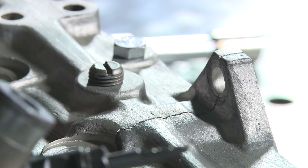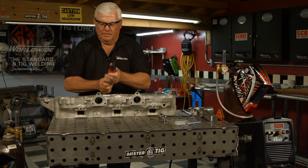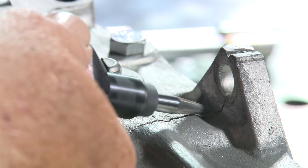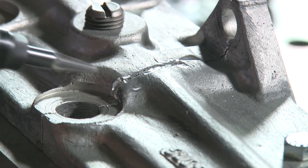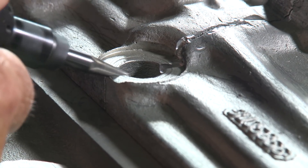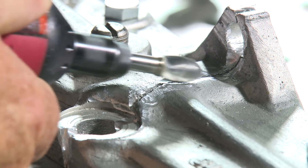I'm going to grind down this tab so I can get full penetration, focus in on this area and the back area so I've got it all lined up. Then I'm going to grind a little channel in there, and once I get the channels where I want, I'll go ahead and make a couple of spot welds. In my grinding, you probably noticed I was grinding away from where I'd normally weld — the reason is there's an oxide layer on here. This oxide layer is pretty tenacious; it melts at anywhere from 3,400 to 3,600 degrees Fahrenheit. With the semi-smooth bit, I go ahead and remove that oxide right where the weld and heat-affected zone is going to be.